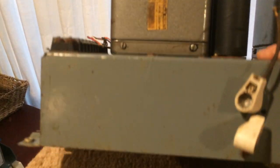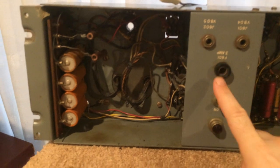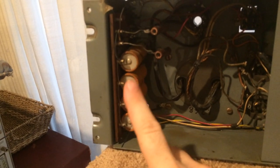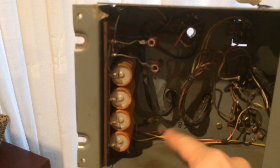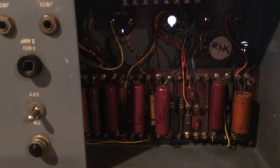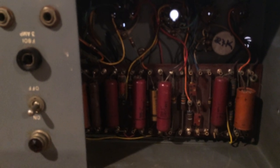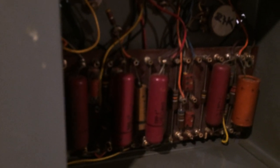Let's flip this over: the power switch is on this side, there's the fuse, and when you look inside you've got more power supply filter caps. These are the wires for the power transformer; that's the rectifier tube socket. On this side you see a nice board containing the caps and resistors for the phase splitter and driver section — that's the volume control pot. This is all original and all stock, and it was still working and being used in year 2000.